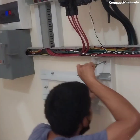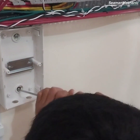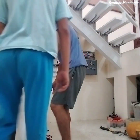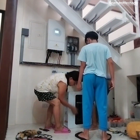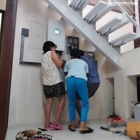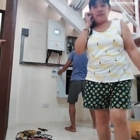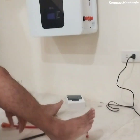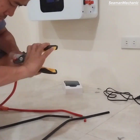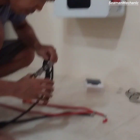Install the battery breaker box. Because this battery is heavier than me, I need the help of my mother-in-law and my son. I cut the battery cable so that I can put the circuit breaker in between the inverter and battery, and it serves as an isolator switch in between.